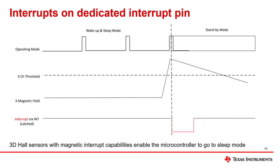Some 3D linear devices have the capability to assert an interrupt pin when the sensed magnetic flux density of any axis goes beyond its user-defined magnetic switching threshold. The interrupt pin is set when the absolute value of the X channel's magnetic field goes above the user-defined XCH threshold. For electricity meters, the 3D linear hall sensor should be configured to look at the absolute value of the sensed magnetic field when determining if the threshold has been passed — this is necessary to detect both the north and south poles of a strong magnet. Since the hall sensor's interrupt pin can wake up the microcontroller when it is in a low power mode, the microcontroller can remain in low power mode until woken up by the interrupt pin. The interrupt feature and duty cycle power mode can be used simultaneously to reduce system current consumption and extend the lifetime of the backup power supply.